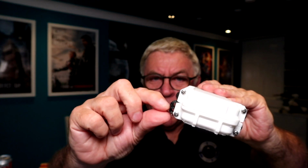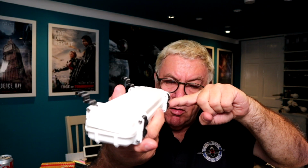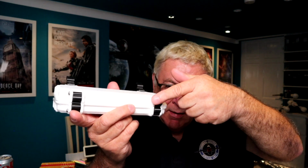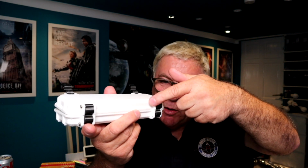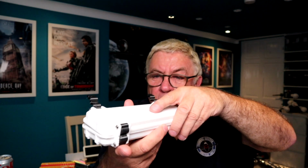So I did a search on Thingiverse. There it is. This box came out really well. I printed the hinges in black, and as you can see, this hinge here has a cutout that goes round the bottom bolt, and it's really cleverly designed. They act as catches like that, so you swing them up. The hinges this side, I've just got a full hole all the way through, and you just need the right size M3 bolts. You don't need a nut because it's designed so that it cuts its thread into the plastic.